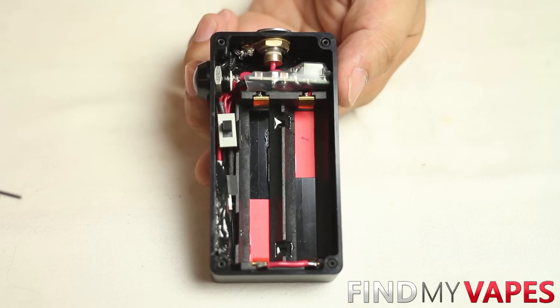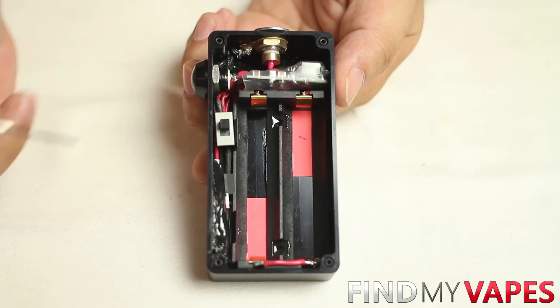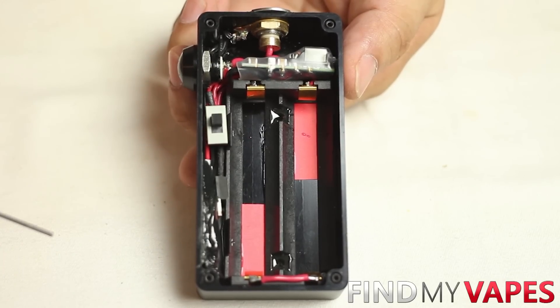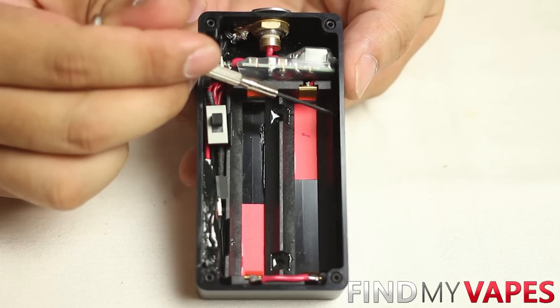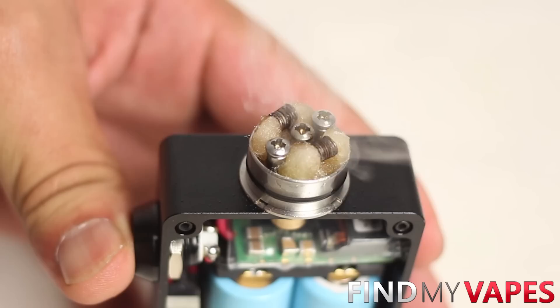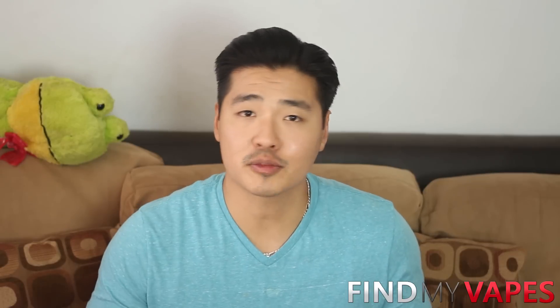After all of that, you are basically done. Tighten up the nut for the fire switch, route all the wires as cleanly as possible, and you may also want to epoxy the on/off switch to the side of the enclosure. Just remember the battery sled is wired in series — negative, positive, negative, positive. Put some batteries in and make sure all your hard work has paid off. I've been using the OKL T20 chip for the past few months with absolutely no issues — it really is an enjoyable vape, and I know you're going to love it. If you want to build this same box mod, you can get the complete kit at shop.findmyvapes.com. Thanks for watching, and I'll see you on the next one.